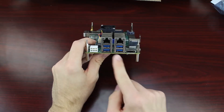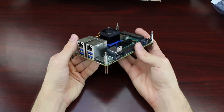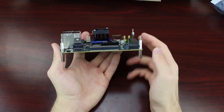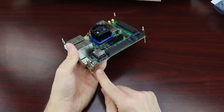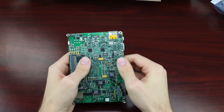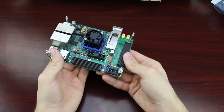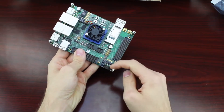We also have a few communication ports in the form of 4 USB 3.0 as well as 2 RJ45. On the next corner, we have our multimedia interfaces in the form of a DisplayPort as well as 2 HDMI in/out ports — that's HDMI 2.0, suitable for 4K applications. Just between those two is the mini-USB connection, which will be used to interface with the UART connection on the board. Just underneath that is the slot for the microSD card, which can support up to 32 Gigabytes of storage. And on the next corner, we can see SATA as well as PMOD and JTAG right next to it.